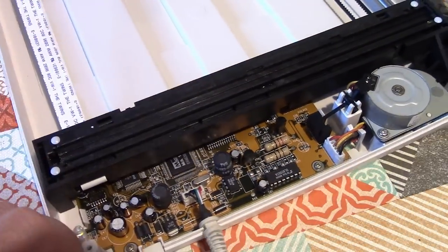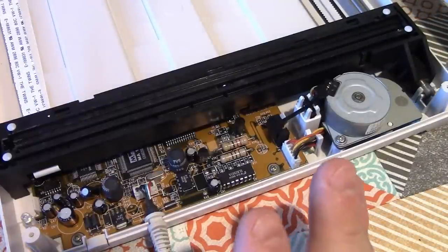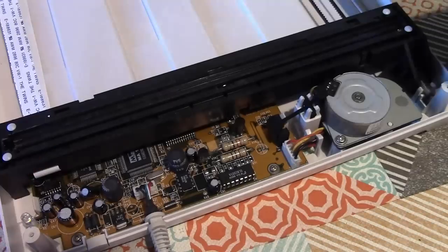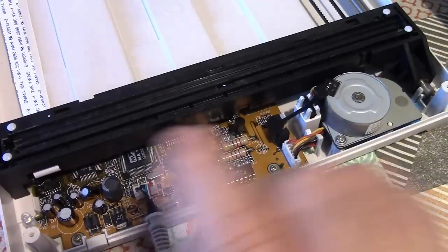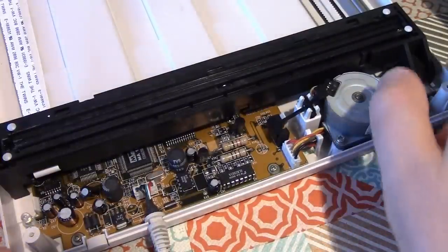So actually when it looks at that white strip, it's just seeing black. And as a result, it's completely overcompensating and scanning a washed out white page. Now when I leave that off, when it does its calibration scan, instead of scanning that white strip, it's scanning the open air, so it's calibrating differently. So we can use this to our advantage.